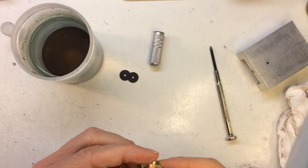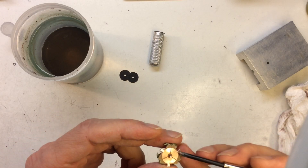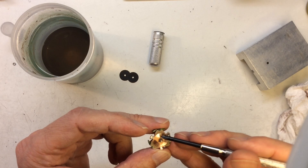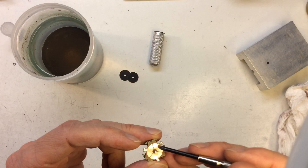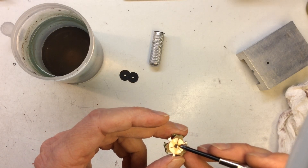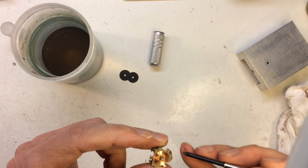Here's another one — a different arm. You can see this one shows a definite wave pattern to it. I've been sanding this for about 10 seconds total time. You don't want to just let it run and run — you'll burn the armature up, you'll burn the comm up. I usually have water on there to limit the temperature, and I never hold it steady for more than about three seconds. You can see where it's touched all the way around in a kind of U-shape, but it hasn't touched on the inside — there's a gap there.